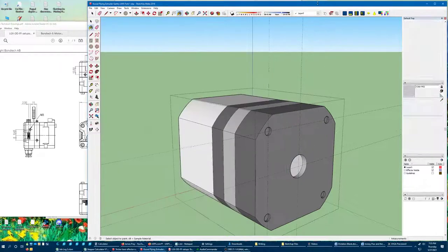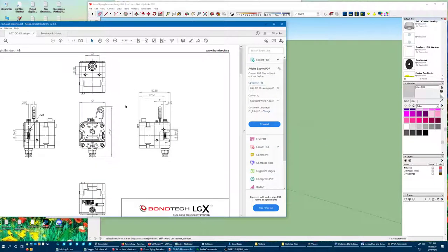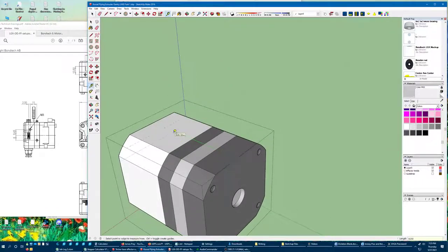There is the stepper motor part all set. Next up, important stuff — we've got these two mounting holes on the sides of that plastic housing. Those are measured from the bore. So we should place the bore next before we worry about the mounting holes. The bore is placed 42 and a half millimeters off the back. And I shouldn't assume it's centered, but they've got a center line there. Snap that guideline to the center.